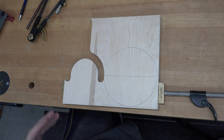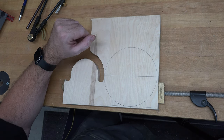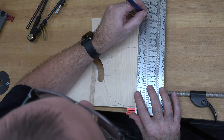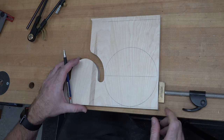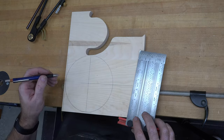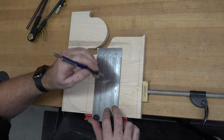Now that we have our circle drawn, we need to draw the back end of our table that will house the support to clamp it to our bench. For that I'm going to put a mark at one end at nine inches, because we want it to have a three inch back support piece. We'll turn this around so I can mark the other side, and we'll mark the center of our circle at three and an eighth, just like we did on this side. We want this to be a four inch wide platform at this end.